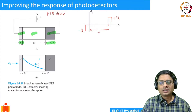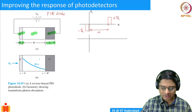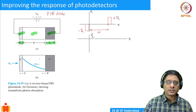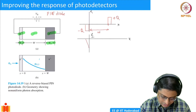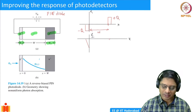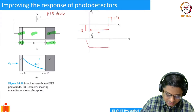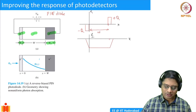Why is this useful? We can compute the electric field profile. The electric field points in the minus x direction, so it is negative. It rises linearly in the depletion region of the P-type side. Because there is no charge in the intrinsic region — it is neutral, with n equal to p — there is no space charge, so the electric field is flat there with no variation. Then there is a linear variation again in the N-type region.